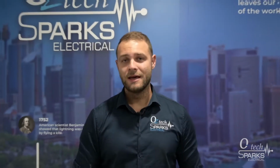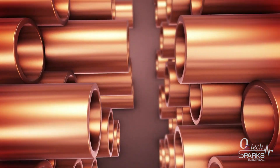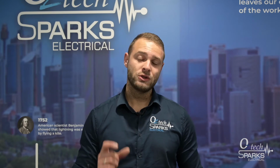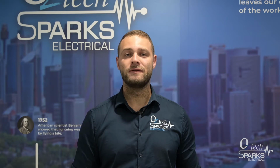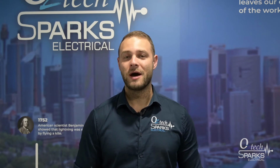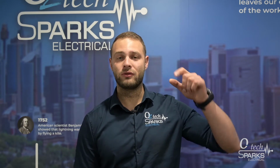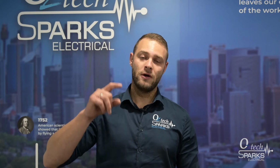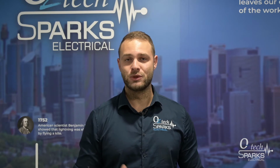Now we are on number 3, which is earthing. In the earlier days, the homes would usually have their house earthed through the main copper water pipes coming into their house. Now, wiring rules have definitely been updated since then. We want to make sure that our earthing for our house is kept under 0.5 of an ohm, which is half an ohm. When we go to upgrade an earthing system for our house, we install a 1.6 meter copper earth rod into the ground. We hammer it into the ground. We have to make sure that 1.2 of the 1.6 meters is in the ground as a minimum, ensuring that it's getting the best potential out of the earth rod.